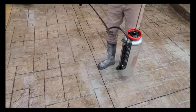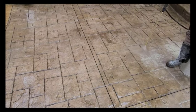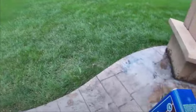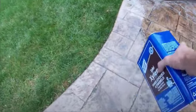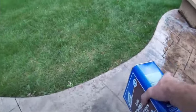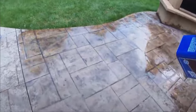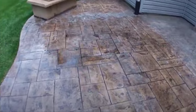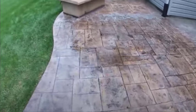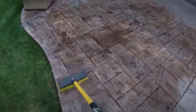You're going to want rubber boots on, and you may want a mask so you don't breathe the fumes. Apply the xylene really well. Or you can just dump it right out of the can directly onto the concrete. Work in sections — you don't want to do a very large section at a time, since you don't want it to dry up. Then just brush it around, scrub it in, and work up that sealer to get it nice and loose. You'll feel it start loosening up pretty quickly.